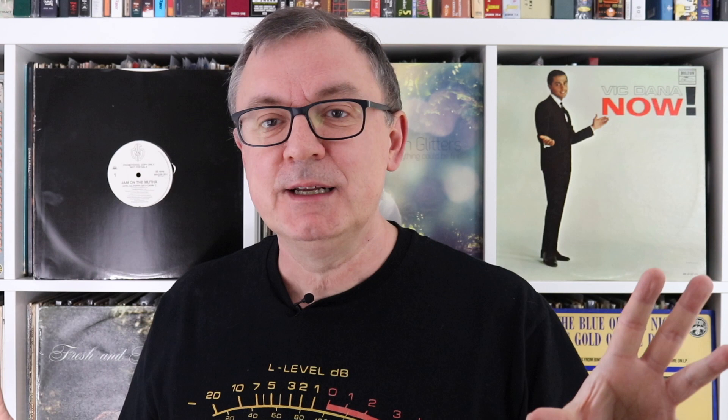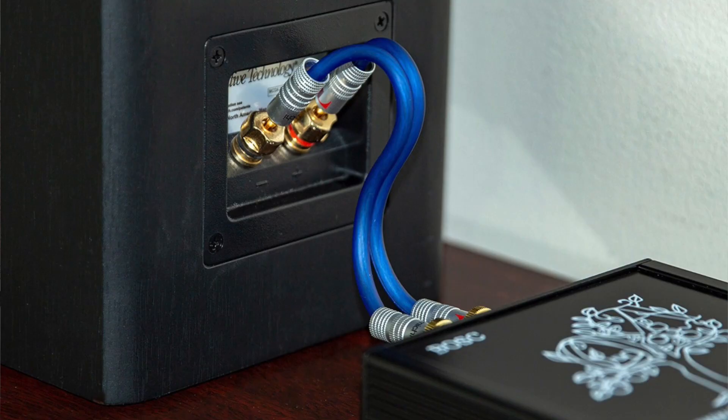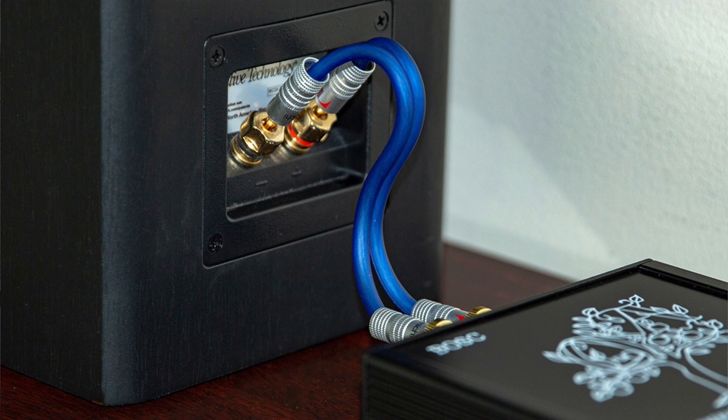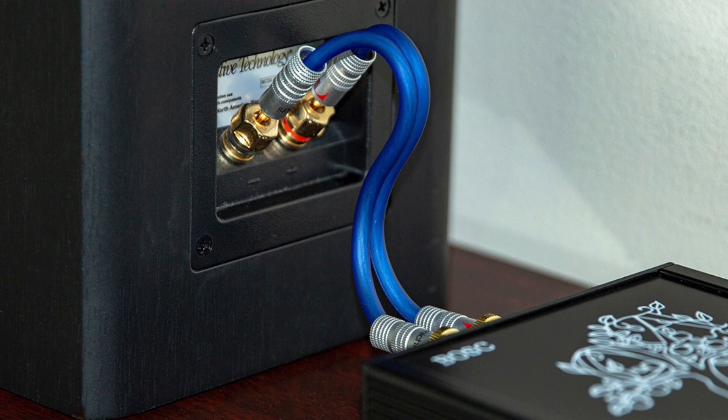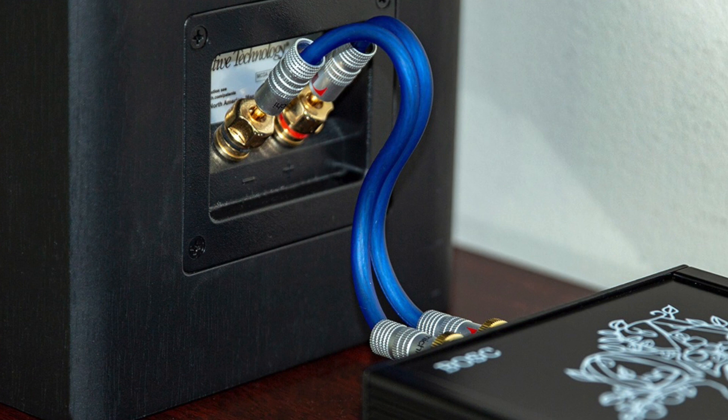There's an awful lot of good stuff going on with these BOSC amplifiers. I love the separation of the boxes and the implementation of gallium nitride technology, and the way Class D has been utilized. The company's recommendation for setup is to place the amp close to the speakers with very short speaker cable, meaning the connection to the amplifier's input will be longer — hence the default to a balanced connection, as it is better at reducing noise over longer distances. The balanced connection also makes for an amplifier that is truly balanced from input to output.